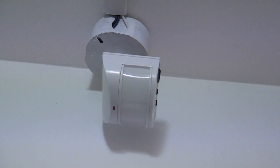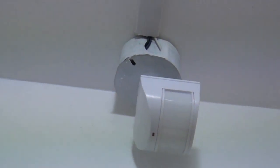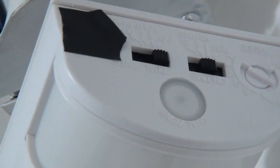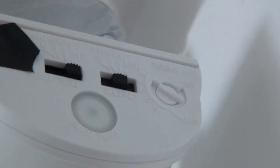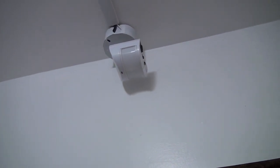So here's what I did instead. I purchased an outdoor motion sensor — the kind that comes with outdoor light sets for the front of your house or above your garage — for about $21. I also bought an electrical box for $1.46 and a lid for about 20 cents, totaling around $25. The sensor has standard settings: sensitivity, an hours-of-operation setting (less relevant indoors), and a timer for how long it stays on. I covered the light sensor with electrical tape because it's an outdoor sensor and the light reflecting off the white walls made it think it was daytime, preventing it from turning on.